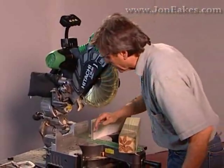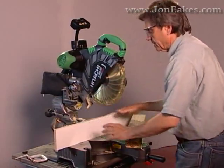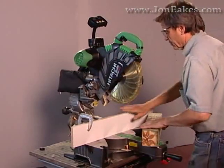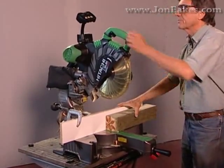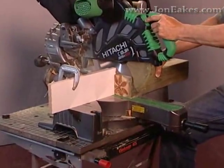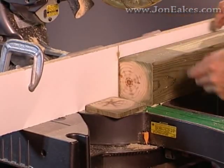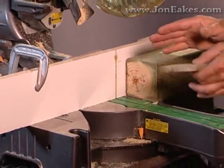These sacrificial fences can be added temporarily or more permanently — they can be screwed in from the back side. Where I only need one side clear, I can clamp it right on top on this side, and that holds it in place. Watch the difference this time. The piece fell off down here completely free and could not move back. It's set up now for making a whole series of multiple cuts with that same fence very safely.